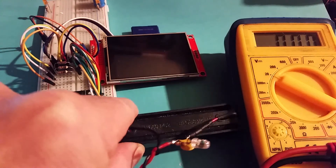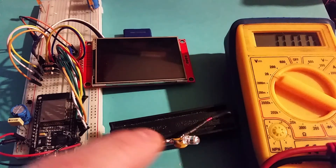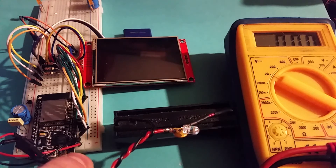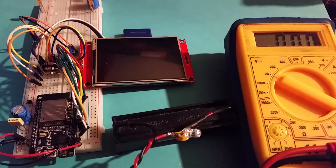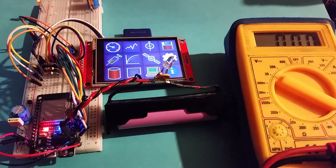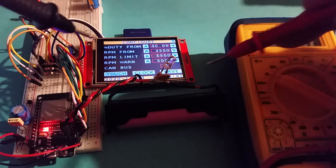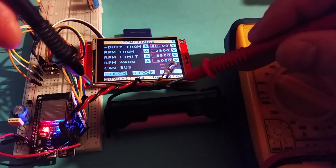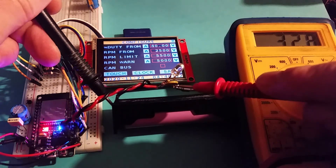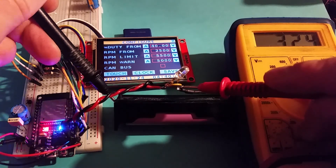Because the diode is in series it should give a 0.7 volt drop. The diode in series also helps protect against batteries being inserted the wrong way in the battery holder, but unless you have a polarized connector for the power — which I don't — you still have to be very careful how you connect up the power. If I connect this up, my application is running, and the voltage coming out going into the circuit is 3.28 volts, which is ideal — exactly what you want.